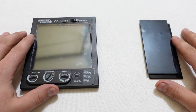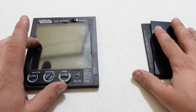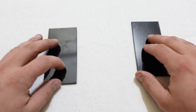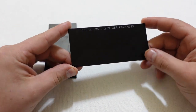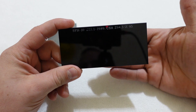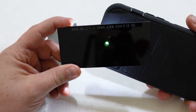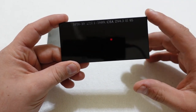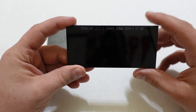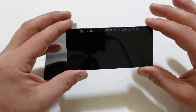Let's talk about the welding lenses themselves. Over here on the right we've got our standard lenses, and over here on the left I've got an auto darkening. Let's first talk about the standard lenses. Now these standard lenses have been around for longer than I've been alive, and they work very simply. They make it so in normal light situations you can't see through, and when you have high intensity light on the other side, you can see it. Basically like a really dark pair of sunglasses. There's nothing fancy about them. They're made of glass, they're very clear so long as you keep them clean and scratch-free, and they last for a very, very long time.